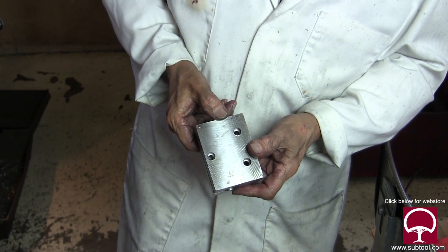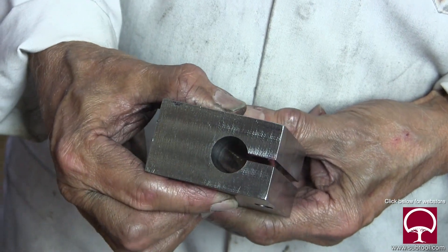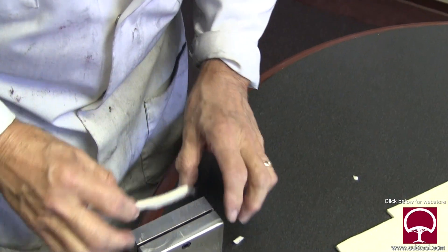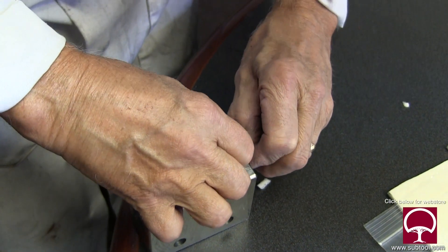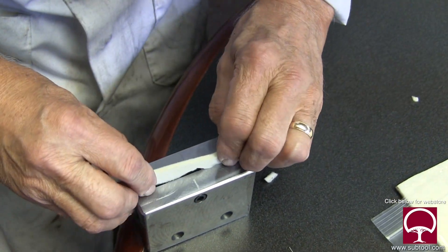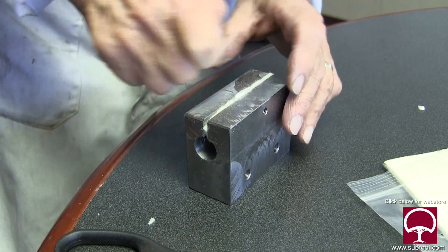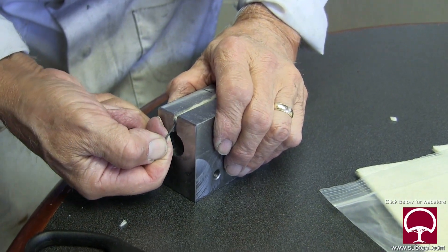So that's pretty much it. I'm going to go over and break the corners with a file — we didn't bother showing that because you know how to do it. Here we took a piece of felt and put it inside to prevent grime, grit, and dirt from getting inside. Besides, it'll act as a lubricant collector. I just pushed it in with a paper clip and kind of got it lined up, then put a little oil on there.